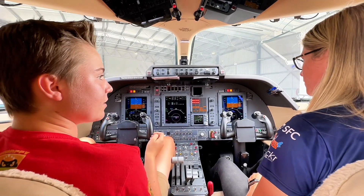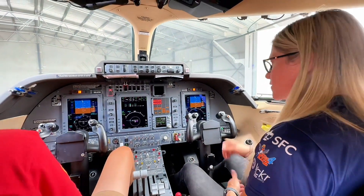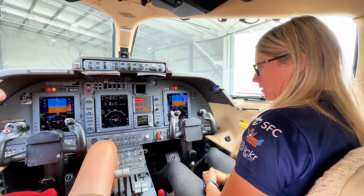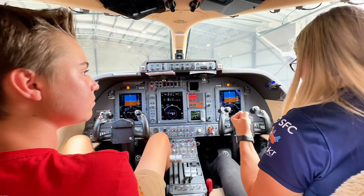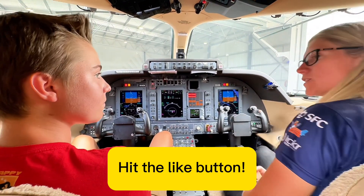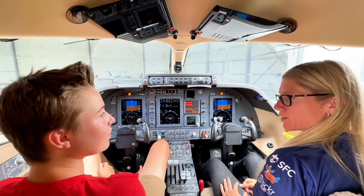How do you tell if there's ice on the wings? We'll actually get an ice indication because obviously if you look back, you can't really see the wings. What we have is a little probe that sits underneath the nose of the aircraft, and we'll get an ice light if we start getting any icing — it'll flash up and tell us. Then we've got the ability to put on our bleed air, which heats up the wing. We've also got boots on the intake of the engine — they pump up with air and push the ice off. And then we've got continuous anti-icing on the propellers and windshield heating as well, so these panes heat up to keep it from fogging up and getting ice on it.